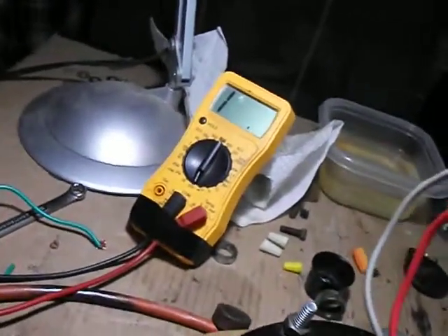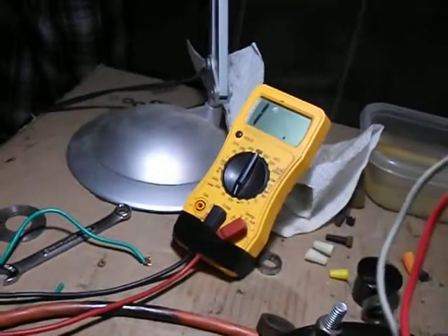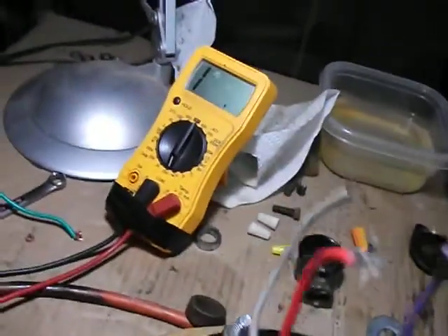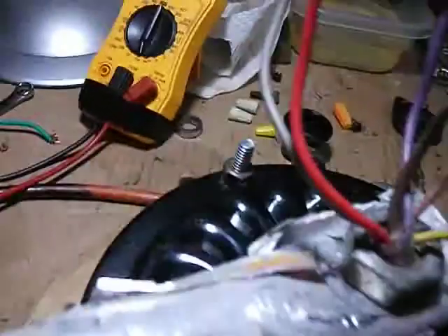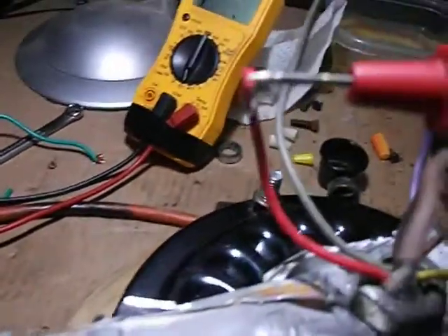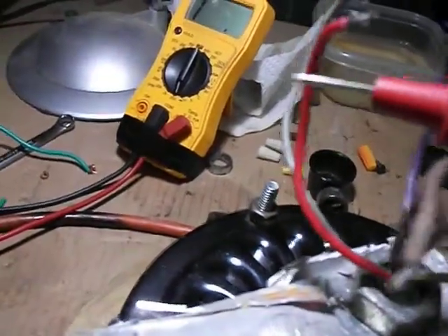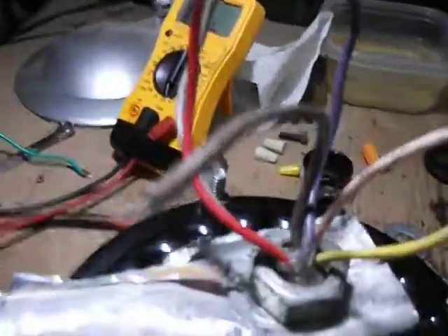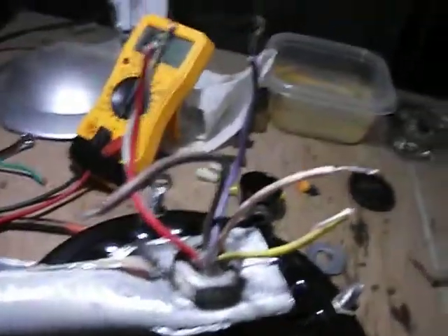You just want to check each wire with the other wires — touch this one together with this one like this. Touching two wires and getting no reading at all, so you move on to the next wire. If you want to start with the red wire, keep one probe on the red wire and take the other and touch all the rest until you get the highest ohm reading. Hopefully I'll be able to come back to this when I have a person to hold the camera and show you more detail.